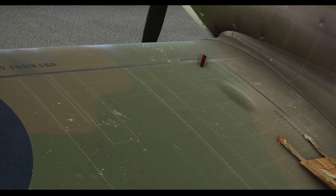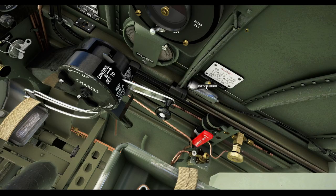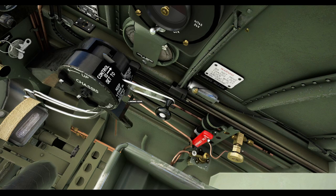There are two other gear indicators beside the lights units on the panel — these are small red rods which project out of the top surface of each wing when the gear is down. To the right of the pilot seat are the harness release switch, emergency gear lever, windshield de-icing pump, and the oxygen control. The emergency landing gear system is basically a bottle of CO2 gas released into the air system feeding the landing gear pistons. It is triggered by using the red lever, but be careful — it's a once-only action. You cannot retract the gear once this lever has been used.